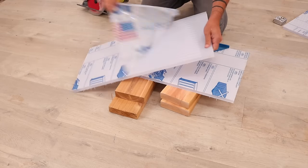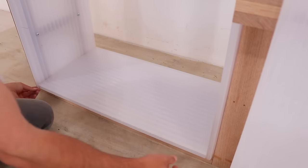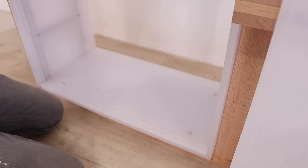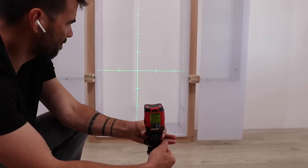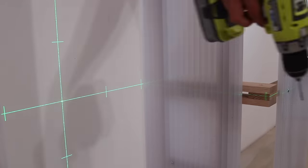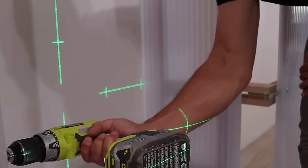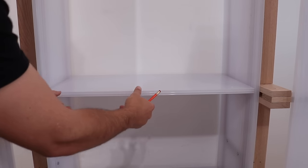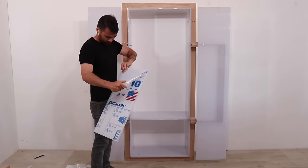The polycarbonate comes with a thin protective plastic film on each side. It was really nice working with a translucent material because I could see through it and knew exactly where I needed to drive in the screws. I really want to make sure the shelves are level, so I used a Skil laser level to project lines on the inside walls of the cabinet showing me exactly where to drive in the screws. The shelves rest right on top of the screws. If I wanted more substantial supports I could cut small pieces of oak and screw those to the interior walls.